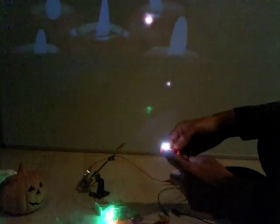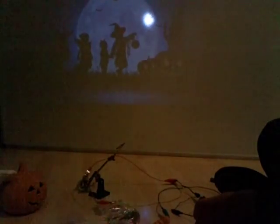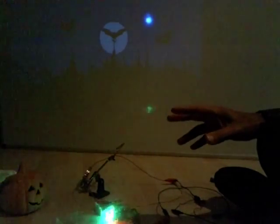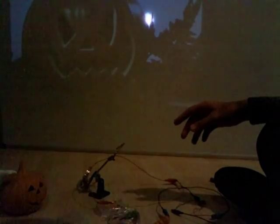All you do is remove the LED and attach your own light source to it. I even tested it on a string with 100 LEDs, and it lights up as well. It's not bright, of course, but with 100 LEDs, it's over 5 meters. You can light up a complete room with it. So, and that all for only 50 milliamps at 4 volts. That's 200 milliwatts. It's lovely.